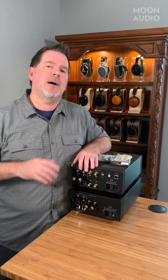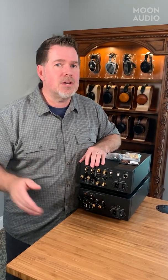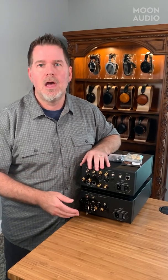Some people are inclined, when they've got just RCA inputs on their amplifiers, to say the balanced output in my preamp sounds better, or it might be better, or it's a true balanced versus a pseudo-balanced output. Should I use that XLR output to go to my amplifier that's only got RCA inputs? Well, it really comes down to the circuit design. If the design of your preamp is not true balanced but they're doing an op-amp splitter to create a balanced output, and your amp and preamp are stacked on top of each other, I would just say use the RCA outputs. You're not going to get any benefit from the XLR outputs unless you need more gain.